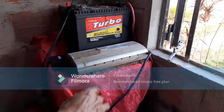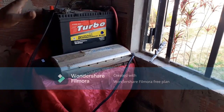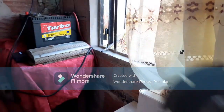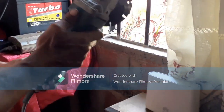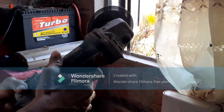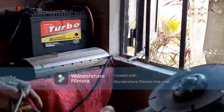For example, the battery is now charging. This is the inverter, but you can do all of this without getting electricity from the grid — this is just a solar panel system. So what I'm going to do here is plug in a grinder to the inverter, turn on the inverter. Confirmed — we're using the grinder. A grinder will take up more amps, so you'll probably get about 20 to 30 minutes of work with just the one battery. This is just to help out temporarily.